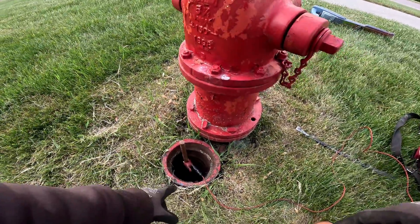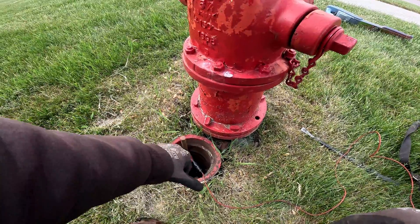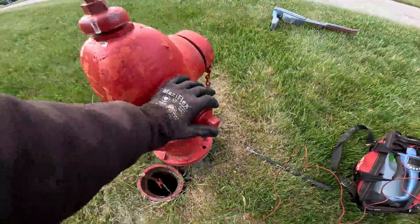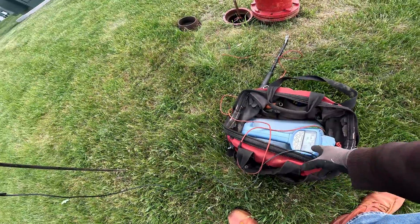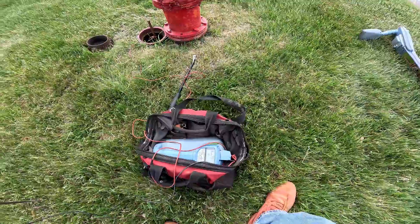So I got my lead — it's centered, it's holding it back so it's not touching any metal. Let's see the output. I'm getting 54 milliamps. 54 — the ground needs to go down more. Need more ground rod.